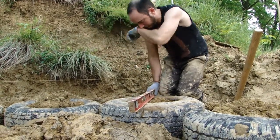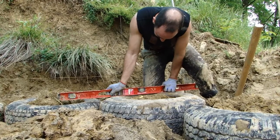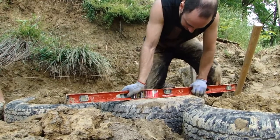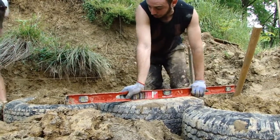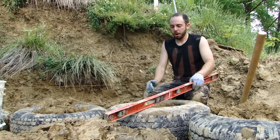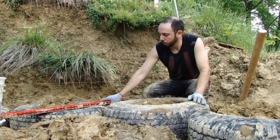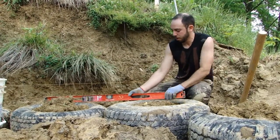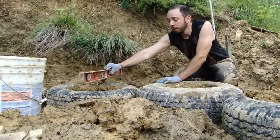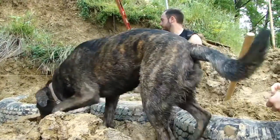These two are level to each other, and you can also go a little diagonal as we did before. That's showing a little bit high, but it's within an acceptable range. The acceptable range is an eighth of an inch. This tire is level to itself. As we go down the line in each direction, we'll level across from sidewall to sidewall — first across, then lengthwise — and that's how we go down the line.